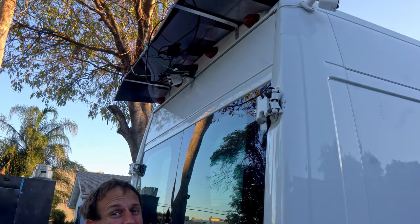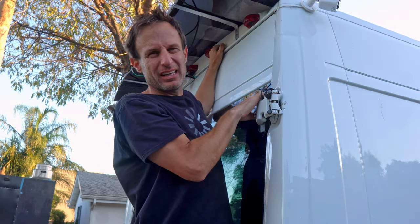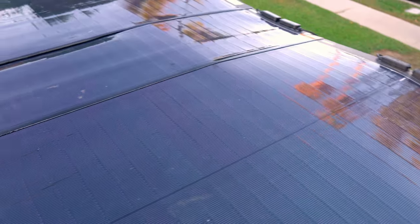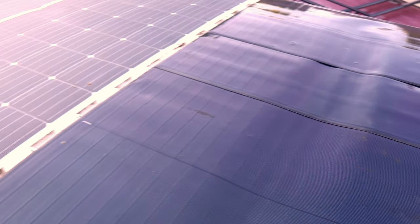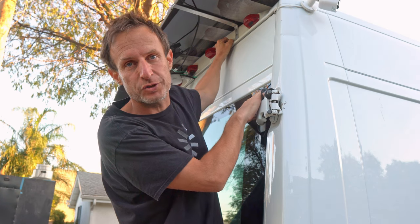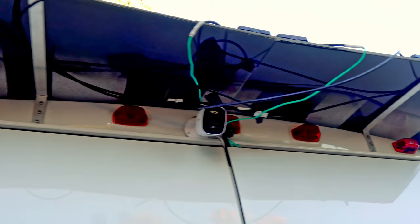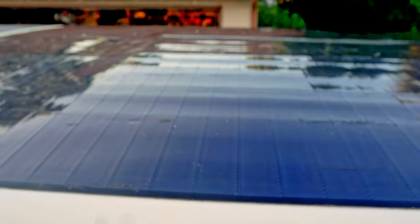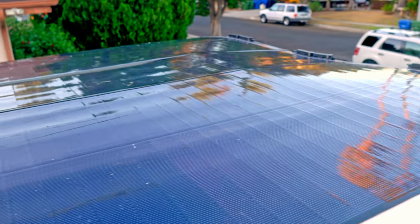Dangerous area — I love the way this thing looks. Tomorrow I'm going to mess with the wiring in series and parallel. I might actually end up using two MPPTs. The issue is two 200 watt panels and one 100 watt panel — it sees them as three 100 watt panels. I might just end up having the 100 watt go to a different MPPT since I have extras. The MPPT from Bougie RV is over 100 volts — I could totally wire this in series.